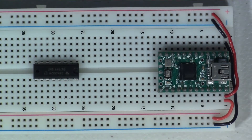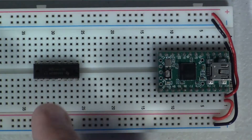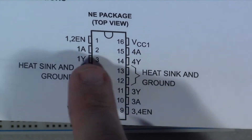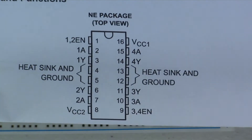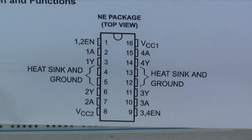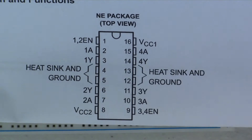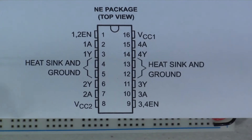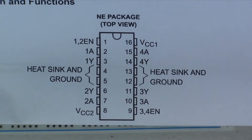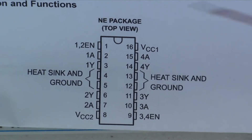The first thing I want to do is wire up the ground connections. This chip has a total of four ground connections: pins 4, 5, 12, and 13. I don't believe all four strictly need to be connected to ground, but it's a safe bet to connect them all. If you're driving a large motor you'd also want to attach these pins to a heat sink — either a physical heat sink or large amounts of copper on your circuit board. For today's video you don't need to worry about heat sinking since we're only driving a small DC motor.